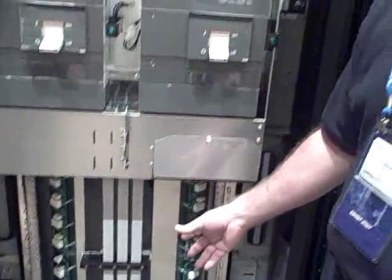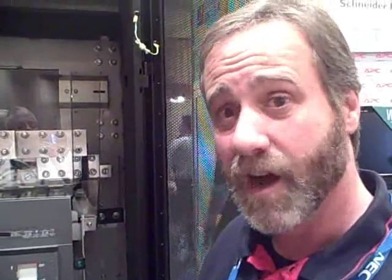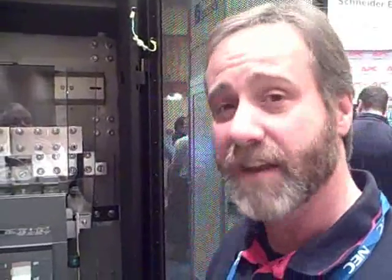Depending on the size, there are three different sizes of breakers you can have. You can have the small 100-amp breakers — fit 16 of those in there. These breakers come with CTs and contact closures, and report up through the system firmware so you know exactly what's going on. For larger deployments, you can put up to eight 400-amp breakers in this. You have the capability to corral which part of the data center is operating on which breaker and report that all up through the UPS — and that's completely included with the system.